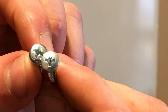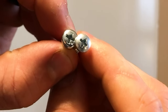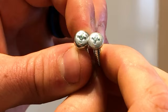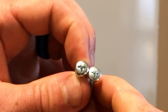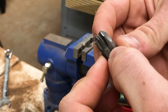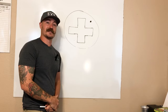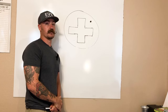That's where the JIS screwdriver comes in. It's designed to fit more precisely into both the JIS and the Phillips, and it's got a sharper point and flatter tip — and the tip makes all the difference. As far as torque goes, the Phillips is designed to cam out, so it's the screw that limits the torque that can be applied. The JIS, on the other hand, due to its design, allows the user to control how much torque they wish to apply to the fastener. This fastener was so good that Japan adopted it as the national standard — pretty impressive.